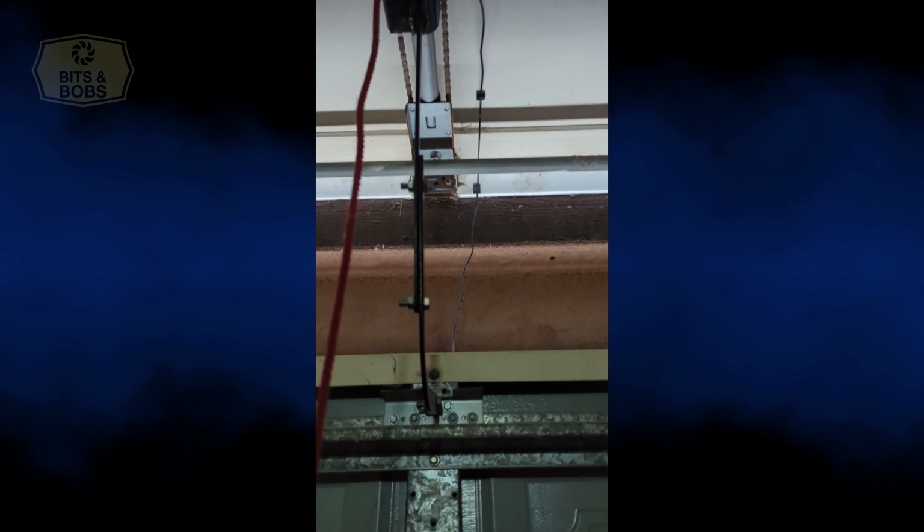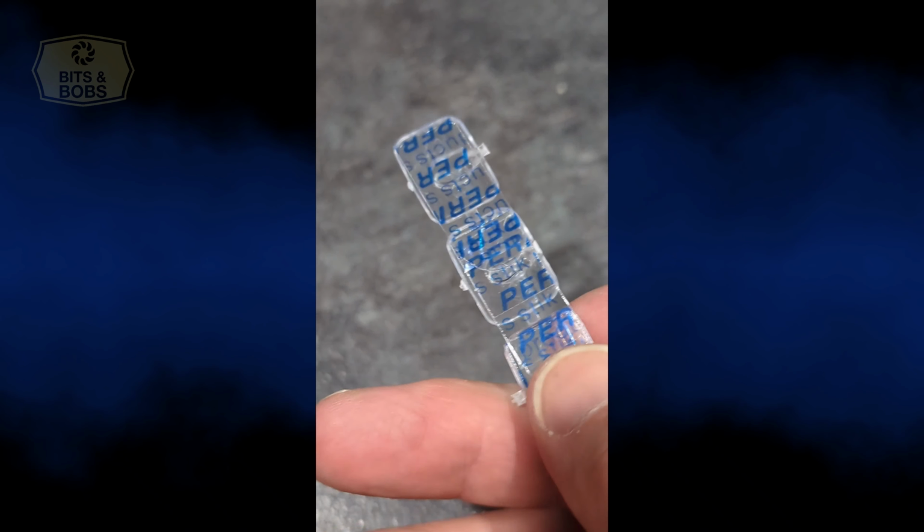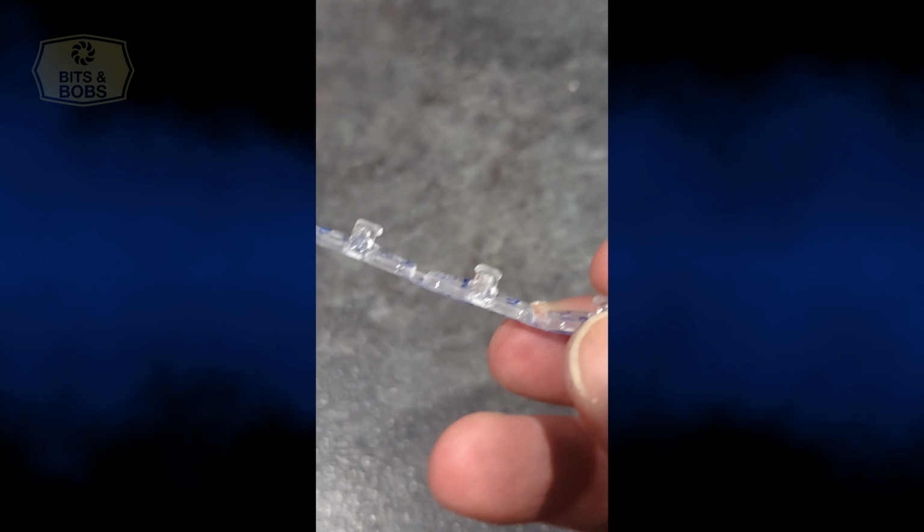The sensor cable is then run towards the door and is placed where one sensor is connected to the door and the other to the edge of the garage door frame, so that each sensor is no more than 1.5 centimeters apart. I went to my local hardware store and purchased some additional adhesive cable holders and used them to keep the cable a little neater along the ceiling.